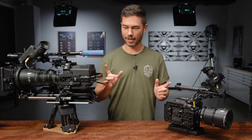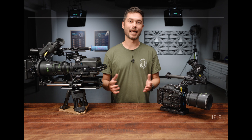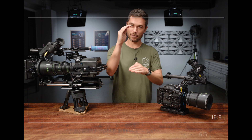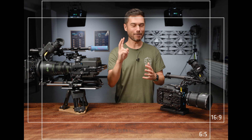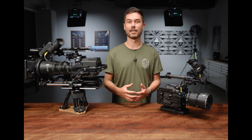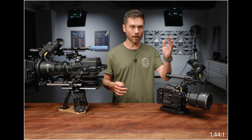Before I get started on the accessories, I just wanted to talk about OpenGate. OpenGate is a sensor format which allows for both widescreen — typically Super 35 widescreen if we think about this camera — and also the taller formats used for anamorphic recordings, so that would be a 4x3 or a 6x5 format, which are slightly narrower than Super 35 but are taller. Being able to have both of those recording formats on one sensor has resulted in us having a sensor with an aspect ratio more like 1.5 to 1, so it's kind of squarer than a lot of other cinema cameras which would just have a 16x9 sensor.